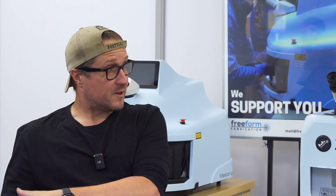Anywhere it can assist me — re-tipping, rebuilding of wires, chain fixes — that's generally the type of stuff you'd use it for. There are other things it does as well. If you weave it into your technique you get a lot more speed. It's a cleaner process at the end of the day — you don't have any flux you've got to clean off. It's just instant.